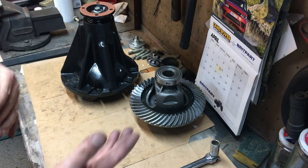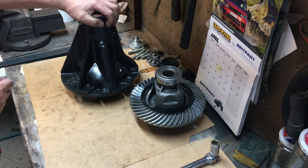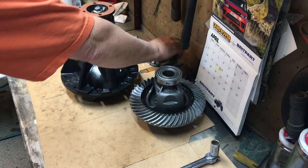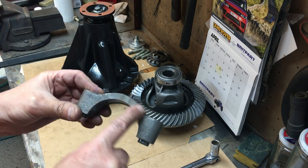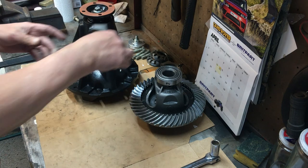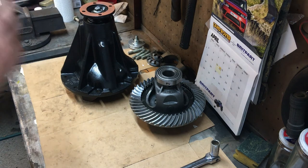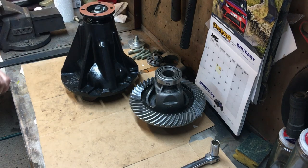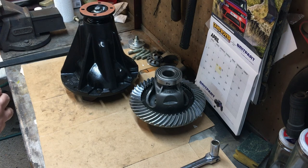I'm going to call that a day for this video. We've drilled and tapped the hole and done the pattern work. If you want to see it all being filmed, go back and look at the front diff video. In part two I'll get this all set up, give it a good clean, put the Ashcroft diff in, and check whether these bearing caps need some clearance ground on them to clear the cage. I'll strip it all again, give the bearings a good wash, then reassemble. Thanks for watching - I'll see you probably tomorrow with the next part. Bye for now.